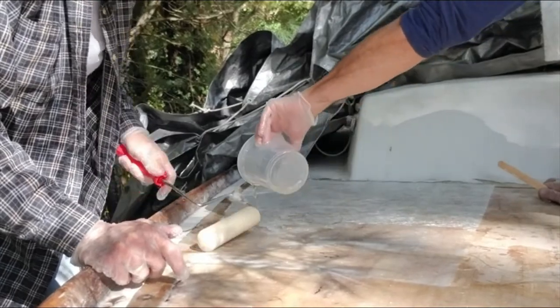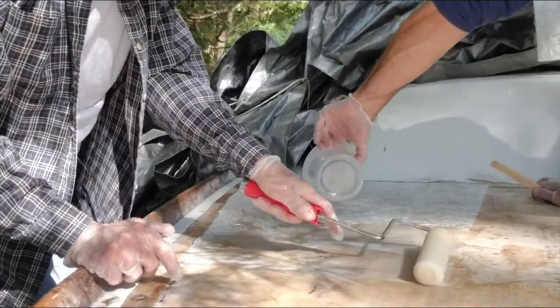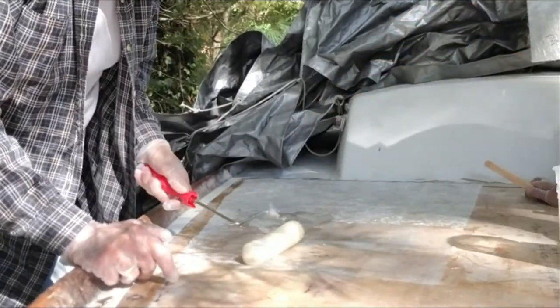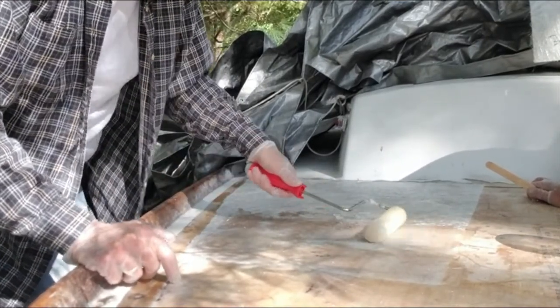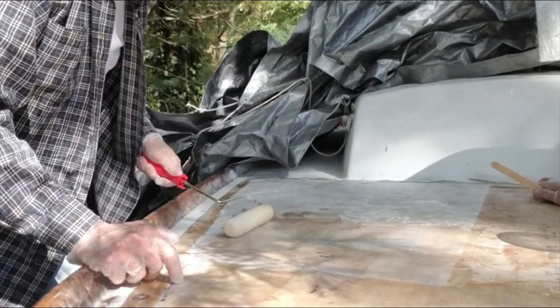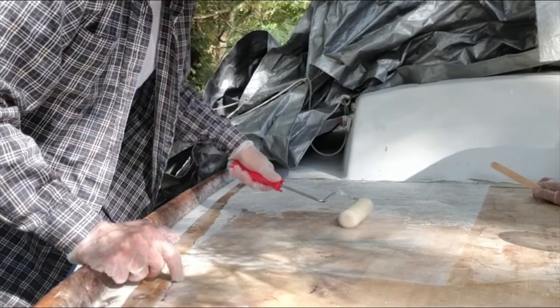For the sake of the video and the guys that are watching this on my channel, the reason I'm not using the fin roller is because it cakes up when you use it on chop strand mat. You've got to use a regular roller, and this is not the one they recommend, but it works, and it is rolling beautifully.